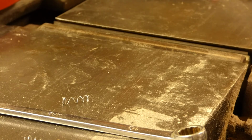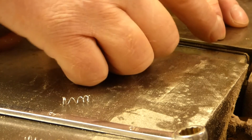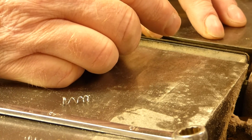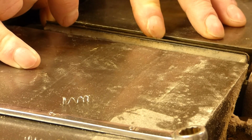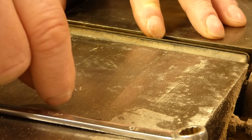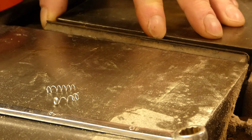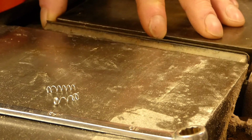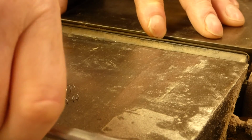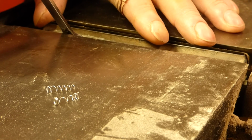So we ran into a small problem on this side. Underneath of the cutter blades on each side, the machine should have a couple of springs that pushes up on the blade so it facilitates tightening it. Instead, it dropped down below where we want it, so that's bad. I tried to make a couple of springs out of a pen spring, but that didn't work for me. So I just cut a sliver of cardboard and stuff down there. So the only thing it's got to do is hold it upright and compress just a little bit so we can get the proper height. And that worked fine for me, and I'll get some springs for the next time.